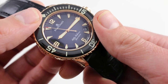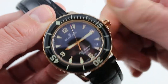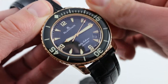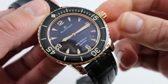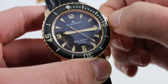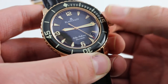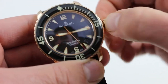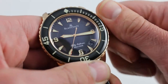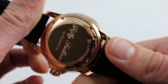Although the indications of the caliber 1315 movement are not complex, the movement itself is incredibly refined. When you unscrew the crown — which feels like the steering wheel of an 80s Mercedes — it's incredibly substantial and beautifully knurled. It feels great in the hand when you're winding the 120-hour power reserve via the three mainspring barrels. The watch has all the cardinal dive watch functions: you can hack the balance by pulling the crown to its extremity, stopping the seconds hand for precise synchronization. In the second crown position, you can use the quick-set function for the date. The movement features 35 jewels, three mainspring barrels, 120 hours of power reserve, and is free-sprung with an anti-magnetic soft iron cage around it.